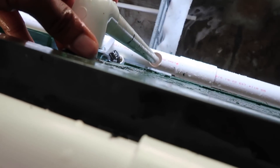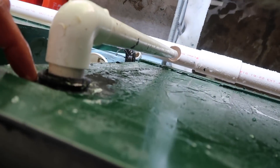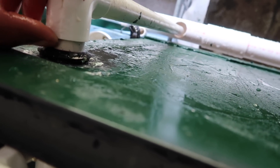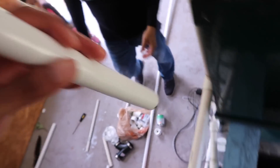Alright ladies and gentlemen. We've installed the other pipe with the other fitting. It was this fitting that was causing the problems. So we had to upsize from a half inch to a three-quarter inch. Now we're just continuing the rest of the construction of this solids lifting overflow with a three-quarter inch pipe. Give me two of them.